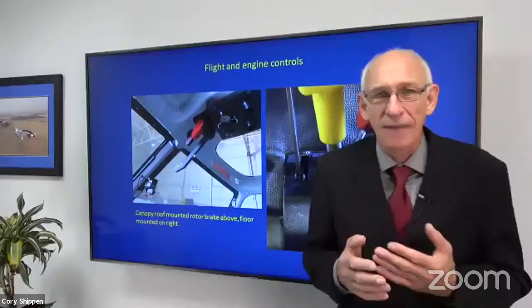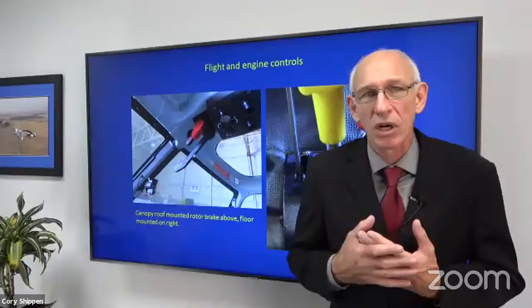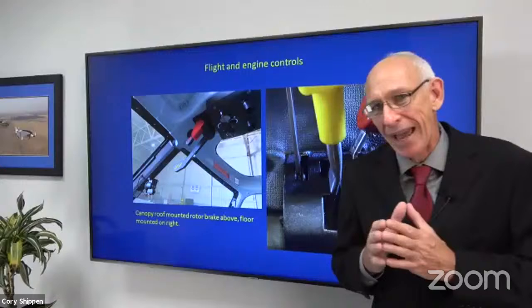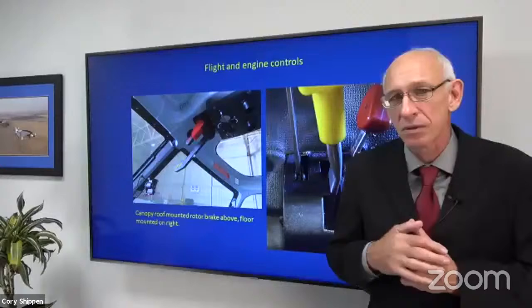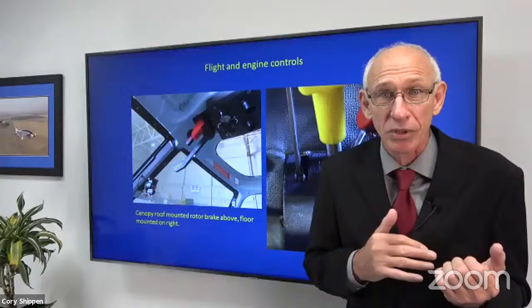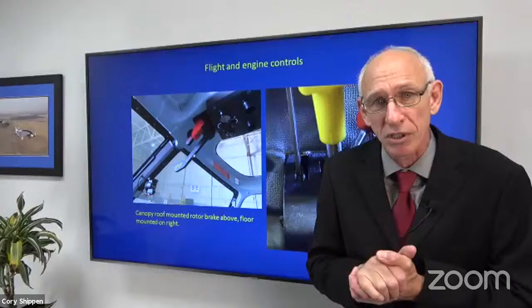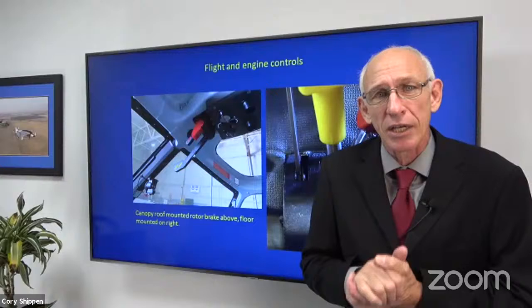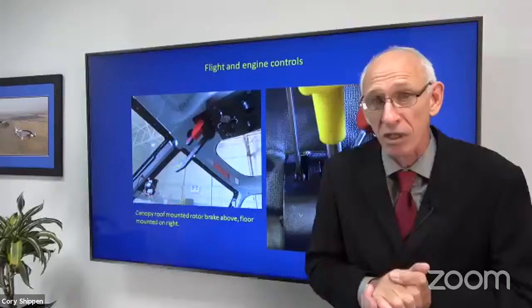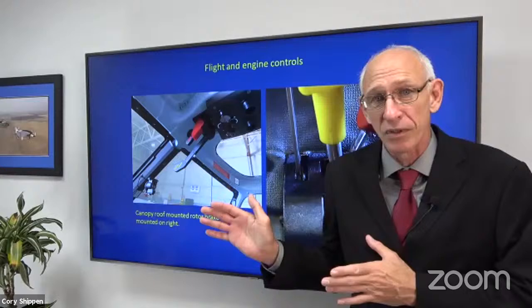And I'll tell you that, in my opinion, it's also not that difficult. I worked as a lead mechanic with 13 helicopters, and sometimes I would have to use our margin. Well, not everything has a margin. As an example, I was going to pull an aircraft in for a 500-hour inspection and use the 50-hour margin because I had another broken helicopter. I wanted to get that aircraft flying so our customers could continue flying out to the Grand Canyon. There were a few things that I couldn't use a margin on. Like I had to grease the swash plate, no problem. That didn't take me hardly any time at all. I did those dynamic excitation, the ground resonance checks, that's the AD we're talking about. I had it done, I think, within an hour. And on that aircraft, I made a logbook entry, the aircraft's flying, I'm using that margin and I'm good.